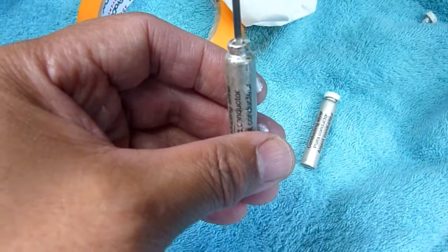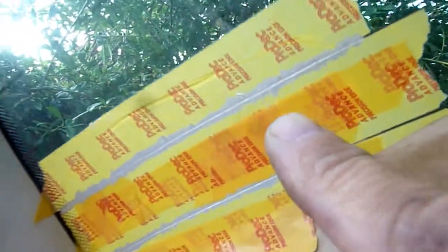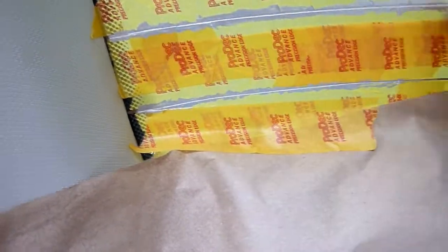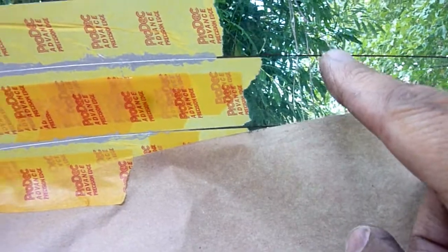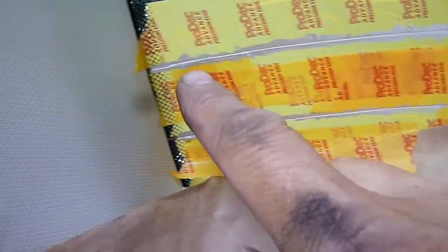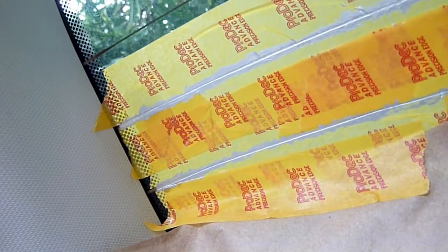The chunky bits at the bottom are the most useful as you get a really thick lump of silver. I've done one layer and if you can see it's like a metal sheen all over it. You can tell where there's a split, gap, or missing strip - it looks bright yellow, whereas where the metal contact is it's brown. The repaired strip will be silver. I'm going to put another layer on and leave it now.